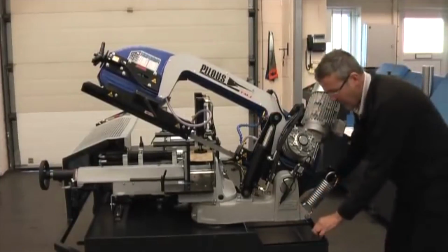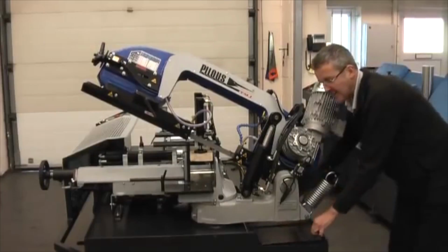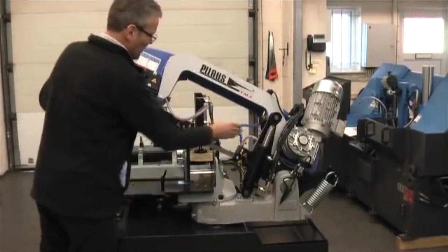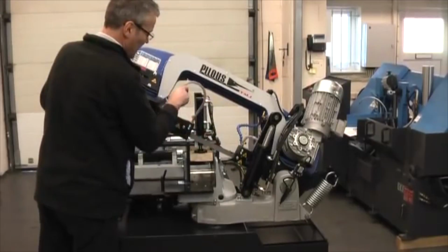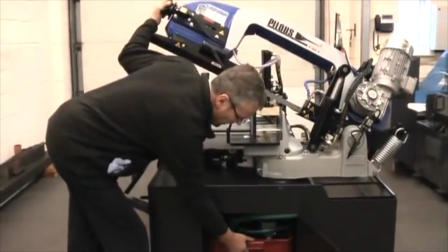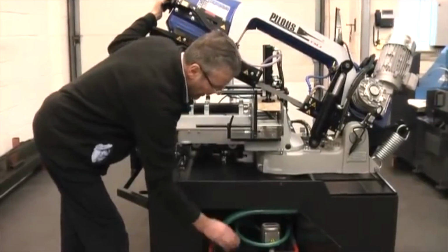Down here, we have an adjustable removable tray, so left means standard tray, so it just comes clear of the workpiece. So for repetition, you're not wasting time, it's just coming clear of the job, and then you can switch it on again and it goes down to do the cut. Naturally, as it's a semi-automatic cut, it goes down to do the cut, then comes up to your predetermined height, governed by this. On this machine, we have a length stop, which is graduated here.